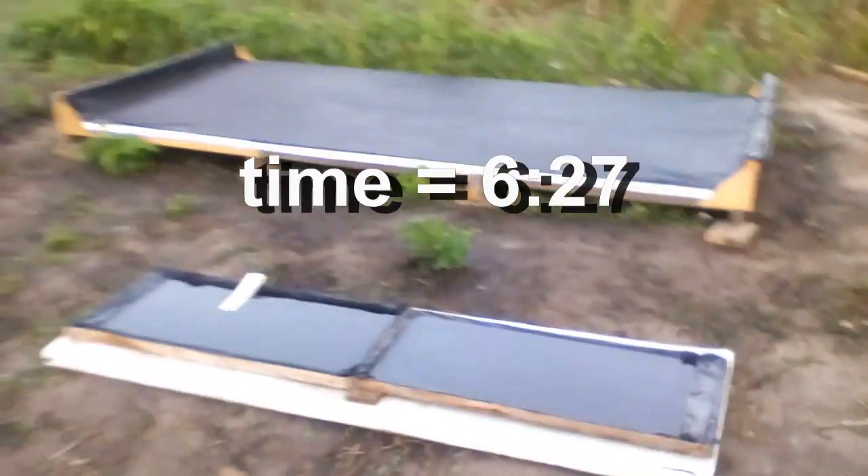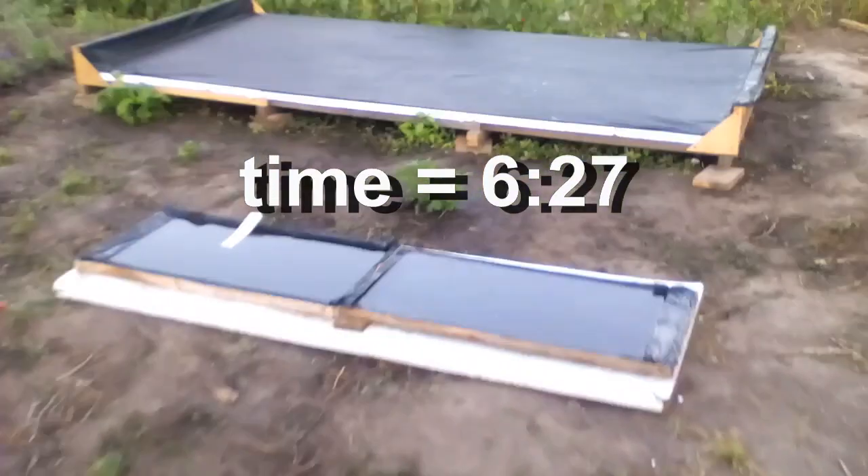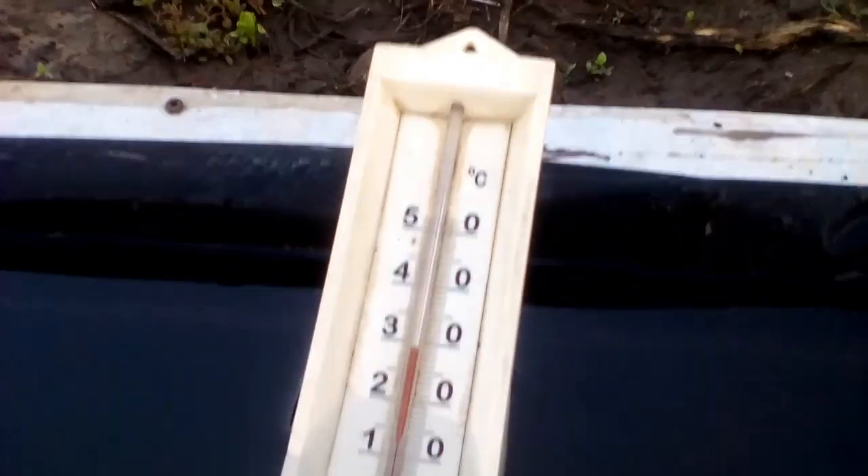Obviously, after rain we reduce the height of the heater to a few centimeters, and it will regain the ability to heat water with good efficiency. Now I show an experiment done early in the morning: this is water poured the previous evening, so it has the temperature of the ambient air. This warm water was poured just a few minutes ago and its temperature is 29 degrees Celsius.